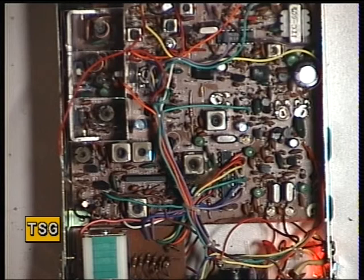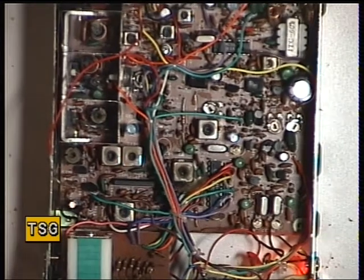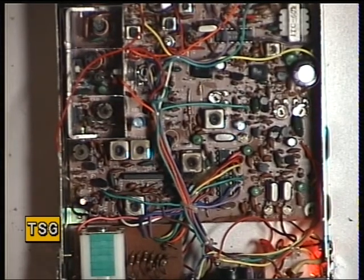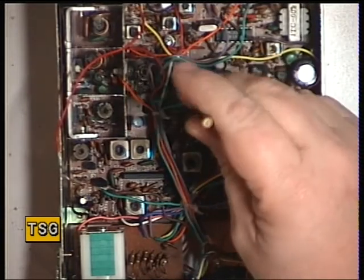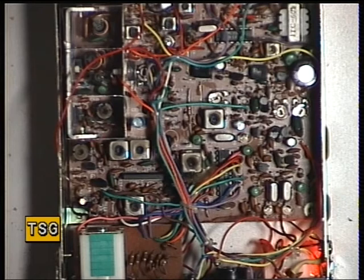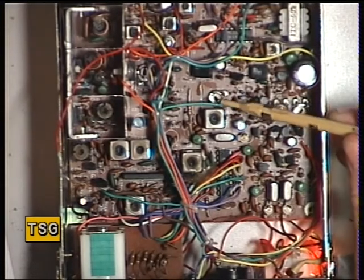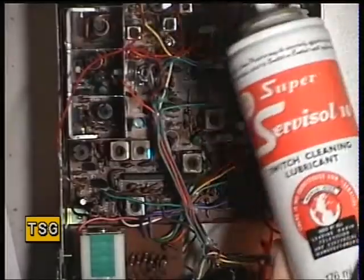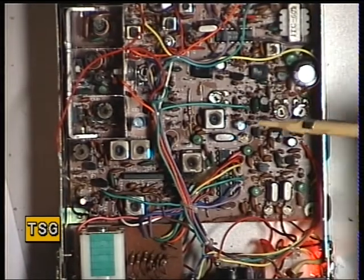Now the deviation — let's hope we've got some. We'll now try and set the deviation up, and it's RV303. We have no deviation, so I had to pause the video. Thank goodness that problem wasn't too scary — it was quite simply dirt on the preset, and I've cleaned that using a service oil spray, which is one I've used for 30-something years. And that's now sorted. If that didn't cure it, we'd change the preset, which obviously we have in stock — only about 15 pence.